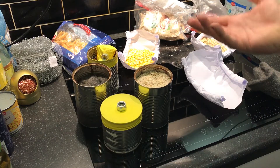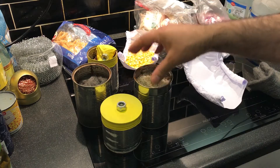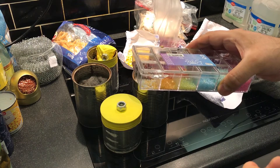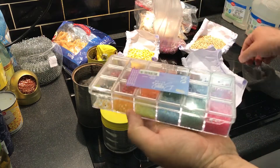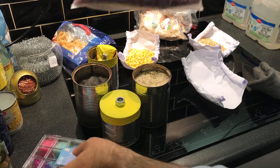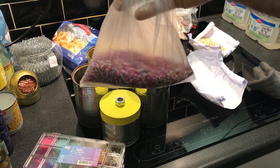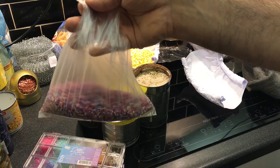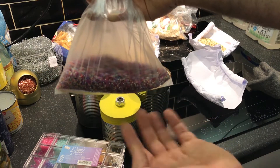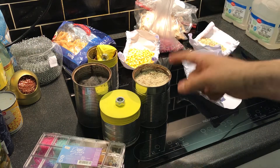I decided to think about other materials — something more robust that doesn't burn and is not a food material, so it can last forever, to improve the long-term performance of the engine. I thought about small rocks, which I could not find, and then I thought about glass. I bought these glass beads and used a lot of them in the engine instead of rice. With this the engine also works and the performance is acceptable — not as good as rice, but reasonably good. This material will never burn and will never get mold, so it is a very good choice.